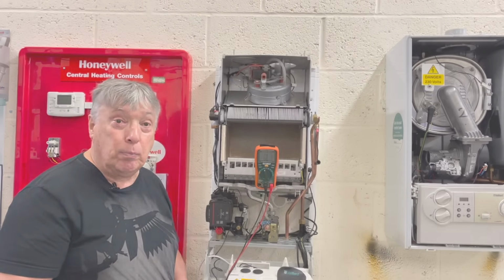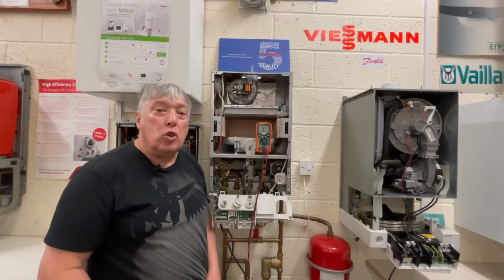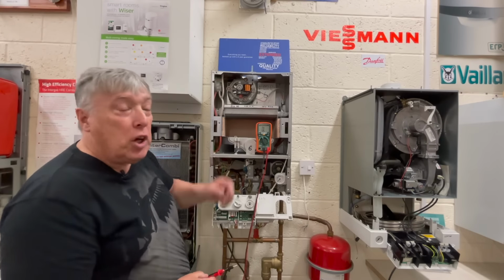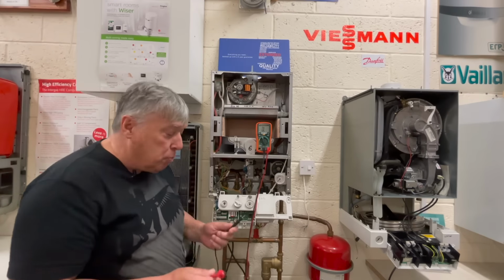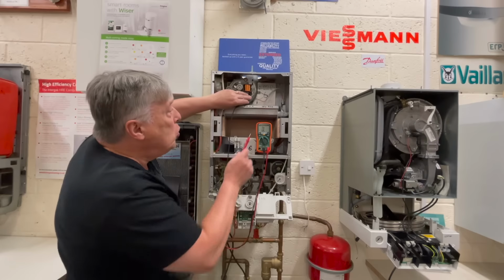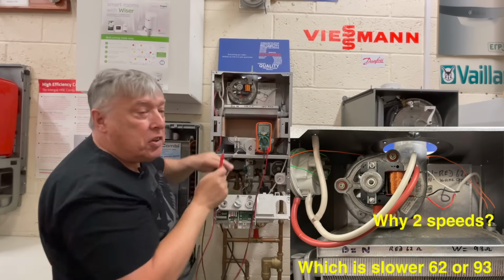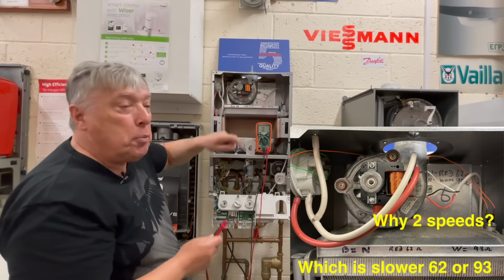Let's do another. On a two-speed fan, it's just another measurement that we have to do to neutral. So we've got two different coils comparing it to the black lead. I've got in touch with technical and they say mid 60s and mid 90s. So first procedure, as before in ohms, we'll put this one on neutral, this one on here, and then we'll see which terminal this is when it comes up. So that's the 62. So that's the red lead, and we can see the other one should be 93.